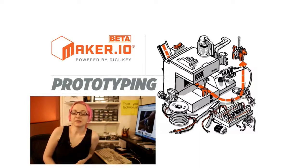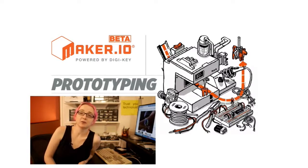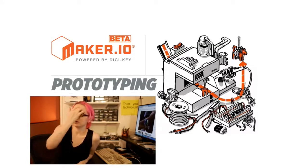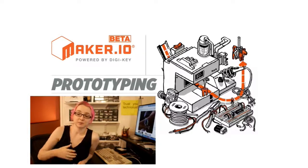Prototyping for me is definitely getting that first PCB, soldering in the components, testing each one. When you lay out the PCB, sometimes you have breadboarded it, like I did a little bit of breadboarding, but there's always little things that catch you. You're not going to get it right the first revision. In fact, we sometimes do up to 8 revisions of a PCB design as we figure out the shape and location, where your antenna is going to be, how close these sensors have to be to each other, interference between components.